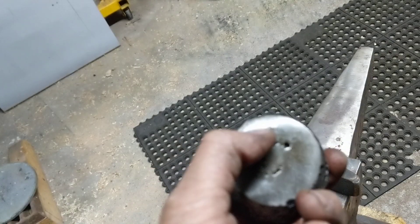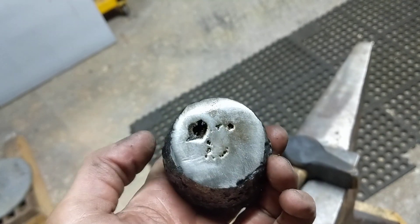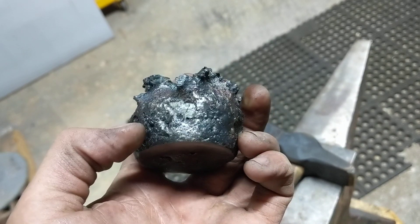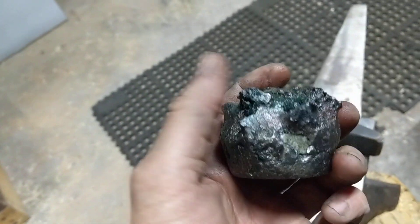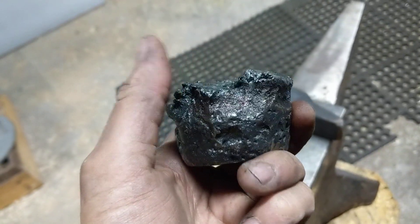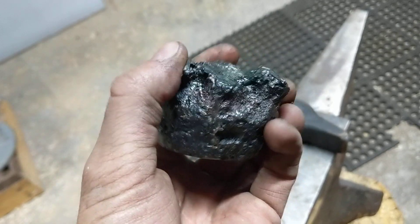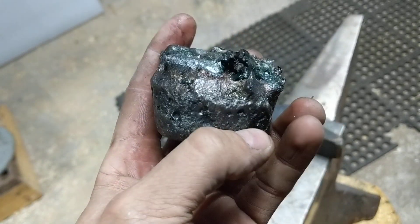We have some massive inclusions. There was a leak in the crucible — a pretty minor one. I didn't really lose much material but I did see some ooze from the bottom, and I saw sparklers, which you see when you overheat steel and accidentally melt it. I would not have attributed that to the charcoal or anything like that — it was definitely steel that was burning.